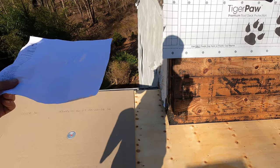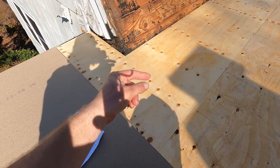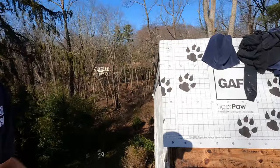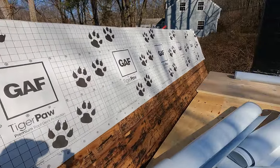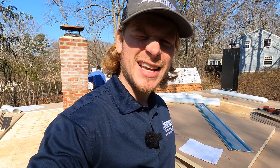I'm having a little bit of a hard time because this inverted valley is kicking my ass. On the map here, we have to fill in this angle — we need to cut a 45-degree angle outward, not inward, because it's an inside valley, not an outside hip. It's the hardest cut of the entire building. Once we figure this out, we'll be all right. Sal has cut this angle very nicely — nice and tight.